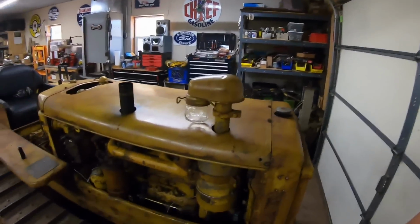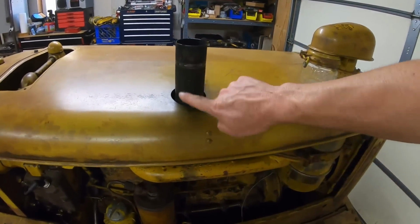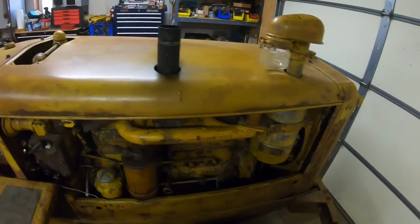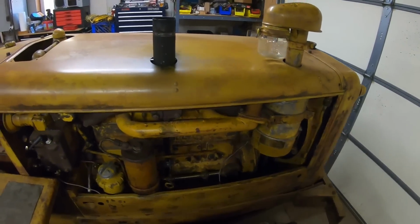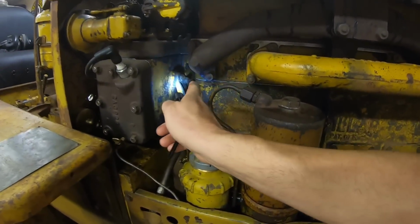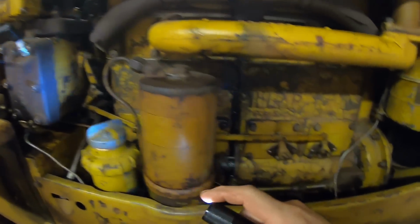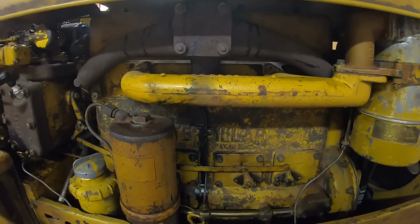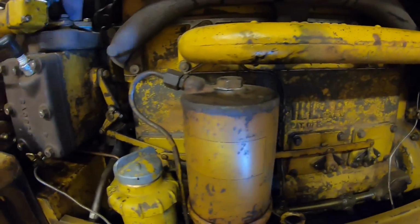So one thing we did do is completely get rid of that wet stacking. It cleaned that pipe right up. But just from the small amount of time I had it idling since we worked it, I did notice, so these exhaust manifolds have a little 1/8 inch drilled hole at the bottom of each port for bleeding off moisture. So I decided to maybe try and narrow in on a cylinder by looking at these.